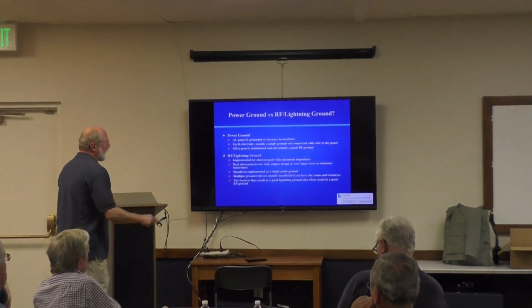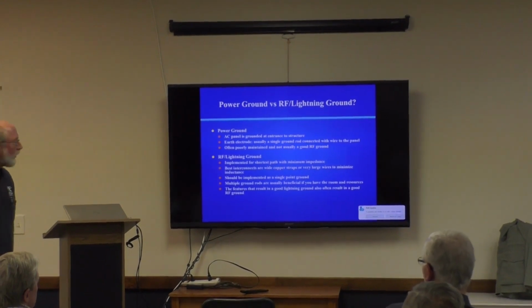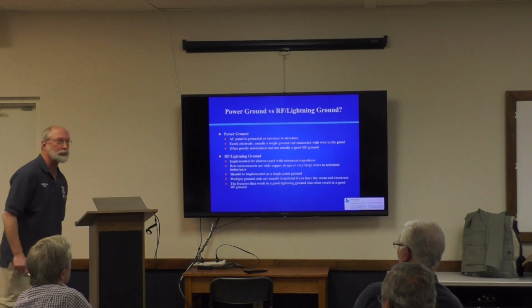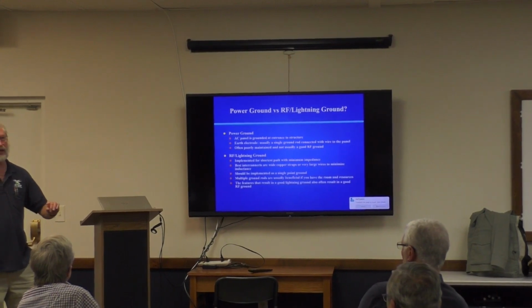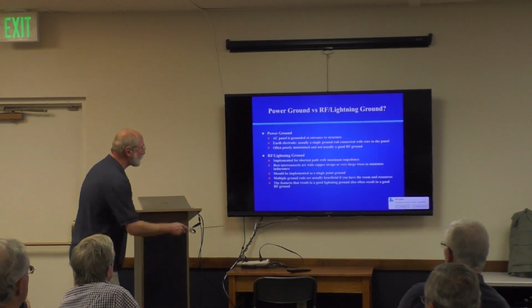The RF and lightning ground should be implemented as a single point ground. That's extremely critical, and we'll talk about that. If you walk away from this presentation with any concept, any teaching in your mind, it needs to be that you understand the value of what's called a single point ground, and we'll explain it.